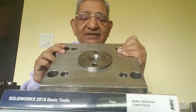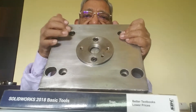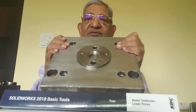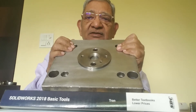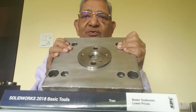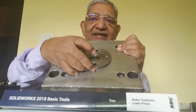This locating ring has now been assembled with the front plate. It is located into the front plate by the counter bore. Now, these two tapped holes — suppose if we want to take out this locating ring and it is not coming out because it is tightly fit, then what we do is we put a screw here and tighten it so that it will go and touch the surface of the counter bore and push it, so that the locating ring will come out. So this is the only purpose of these two tapped holes — to take the locating ring out when it is tightly fit and not coming out.